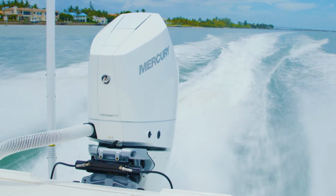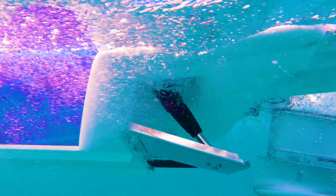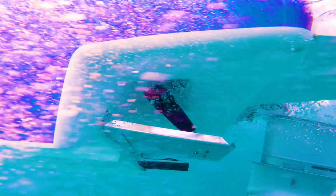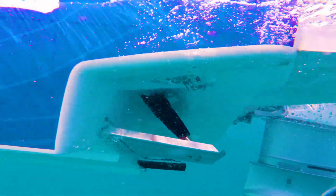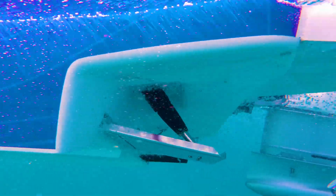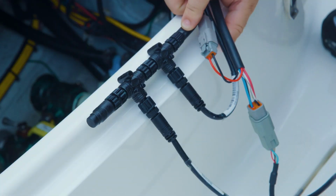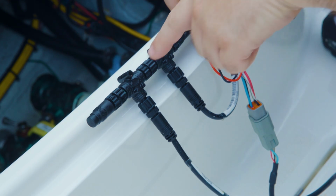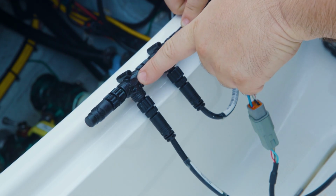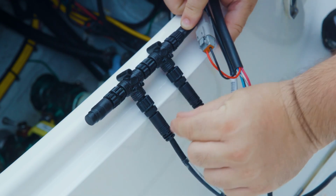At the stern of the vessel, the SD Pro actuators are connected into the Lenco 2K network using the supplied micro-C components. It is important for system functionality that the SD Pro actuators are not connected to the vessel's global NMEA 2000 network. Each SD Pro actuator connects into the Lenco 2K CAN network using micro-CT connectors and finishing with a terminating resistor. Drop cables will connect the actuators to the T connectors.